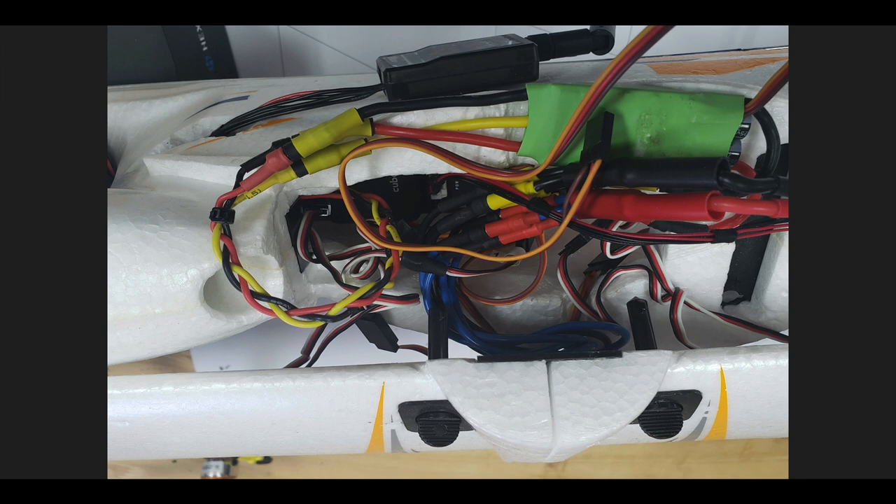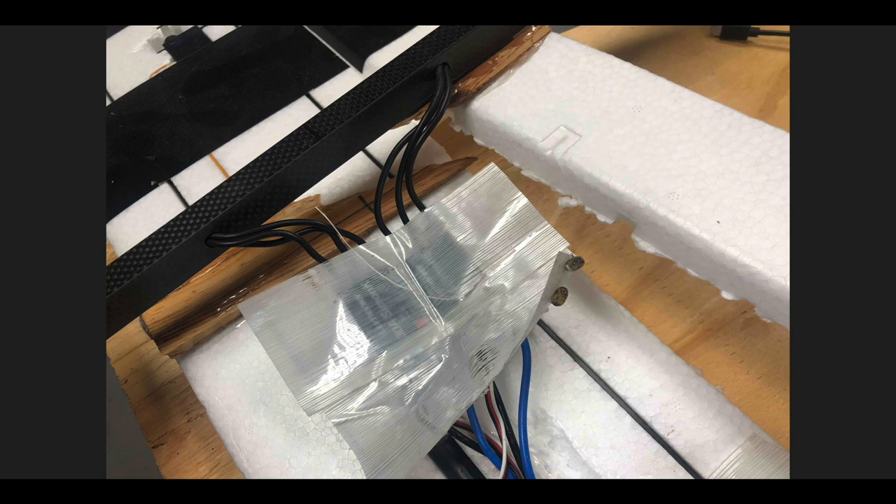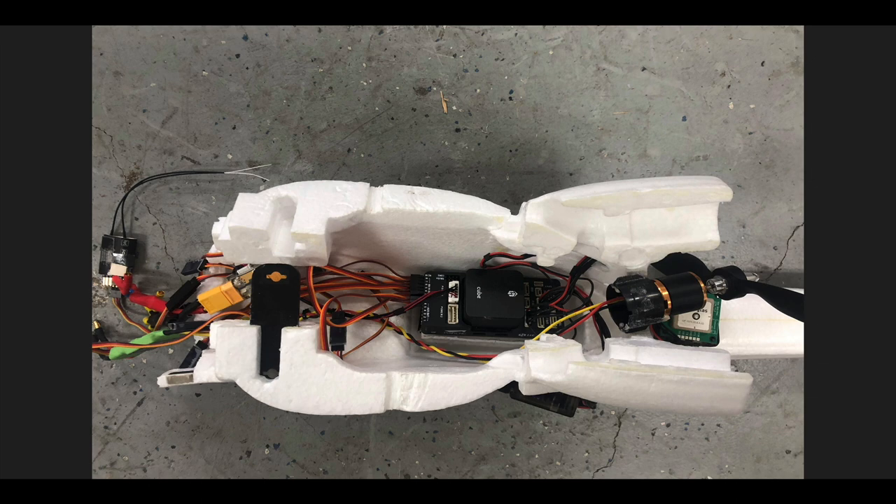We did lose the cover for the GPS module but that's the extent of the damage. All the wiring was still intact, which was good. I was able to disconnect the servos and independently test all of them to make sure we had no major issues. Here you can see I used shims from Home Depot to mount the carbon fiber booms to the wing — and the left one is the one that snapped straight off. This is inside the fuselage; the Pixhawk cube was still intact, which was great. The motor mount completely broke free from its housing.